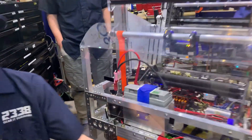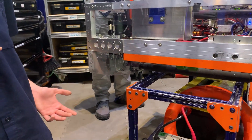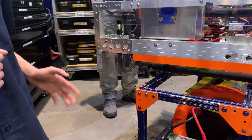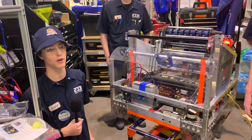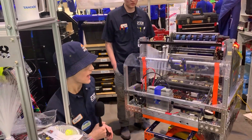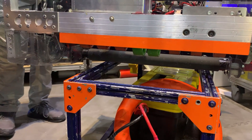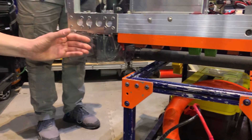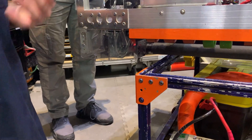Below the frame we have these skirts that wrap around the entire robot and keep notes from getting underneath our frame into our swerve modules. Notes will just bounce off the skirts and keep moving down the field, so we can just run into them. This lets us keep our bumpers at a uniform height and makes them stronger and easier to manufacture. The skirts are also angled in at the front of the robot, so a note will get guided into our collector. We can also mash up against the wall and drive forward or sideways until the note is inside our intake.